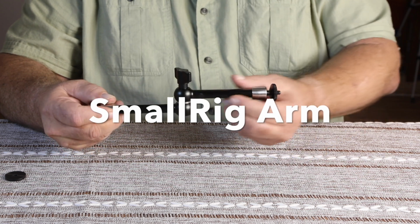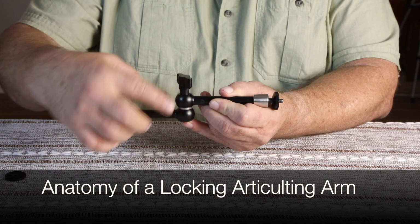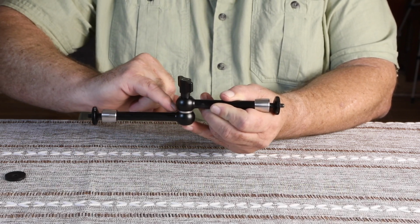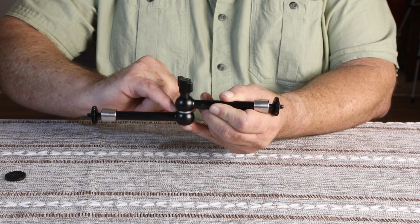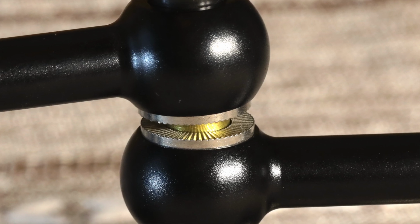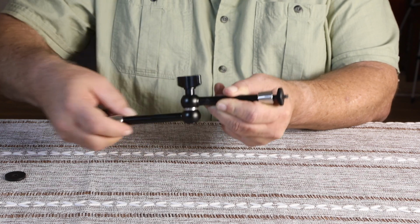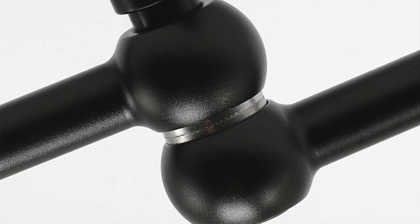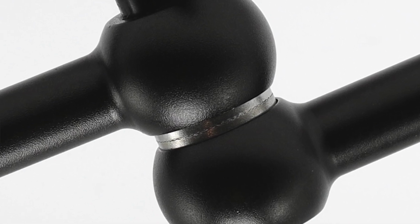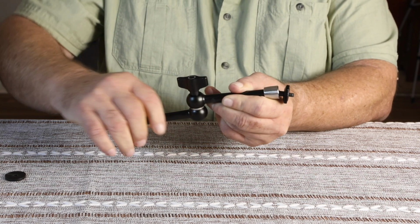So the way this thing works is the wing, this is an articulation. That means it comes together. And in here you've seen other pictures I have of the teeth. When you open it up, it has teeth, and as you loosen it, the teeth release. And so this has 360-degree rotation. And then as you tighten this up, the screw brings the bottom articulation up to the teeth to where they will mesh. And they lock in and they will not turn.